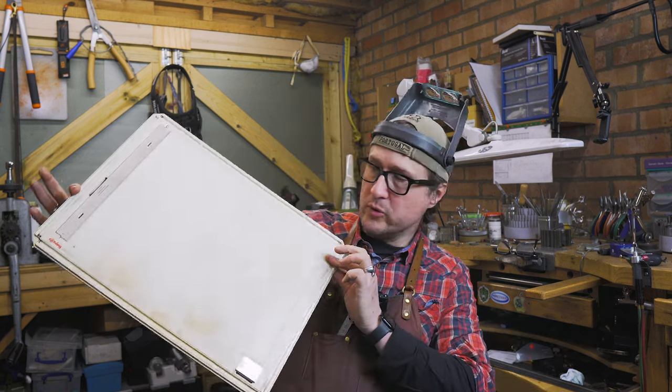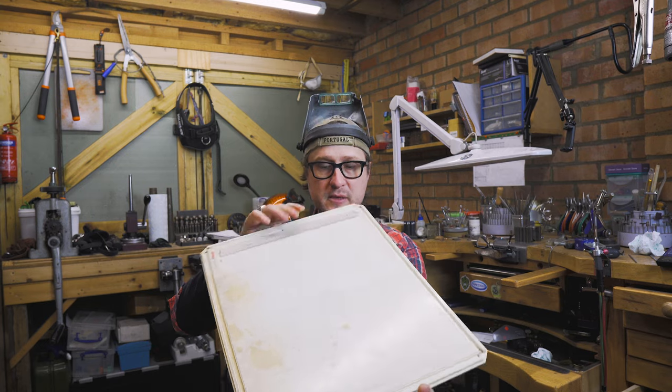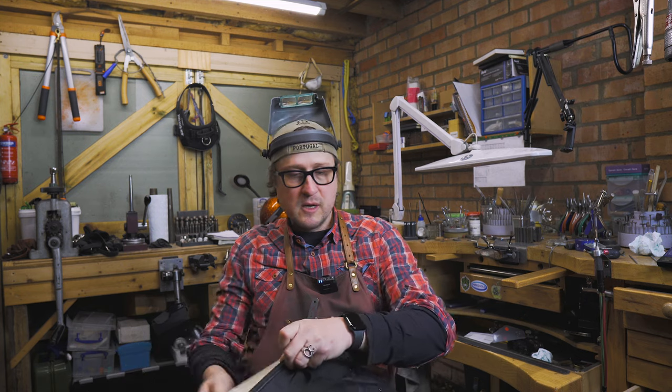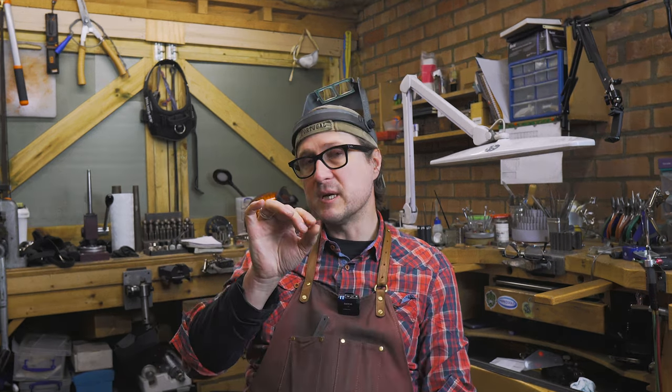Today I'm going to explain how to take a flat plate and turn it into a form. I've got a drawing board — a Rotring drawing board, fairly old, so don't judge me. You clamp the paper to it and use various stencils and fine pencils to draw. I know that's old school, but that's the way I do it. You can do this on computer too, but the simplicity of this project makes it much easier with the drawing board. Make sure everything is nicely clamped and that you're using sharp pencils, because you're going to be cutting exactly on the lines and need to be as accurate as possible.